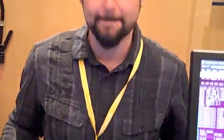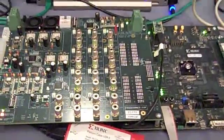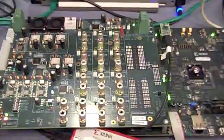This is the first board running silicon. In a second, you'll see the done LED will light up — that says the FPGA is configured. Now we're downloading the software. In a second we'll start Uboot, and then from there we'll TFTP the Linux image over and we'll be ready to run.